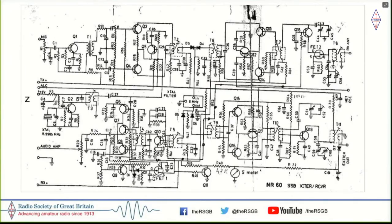But in the meantime, I had got the MOPA transmitter going, which was an EF91 and a 6L6, built by a friend of mine, Amar Victor United 2 Alpha Alpha Papa. So I got on air with this contraption, which was a free-running oscillator, a VFO at 7 megahertz, a Wolf VFO, which directly drove a 6L6. And I used that VFO to beat signals on my shortwave broadcast radio. And I finally got on air and I started making contacts on CW. It was a great time. The sunspot activity was really high, and I was young and there was very little to do. I was in senior high, so it was a good time all in all.